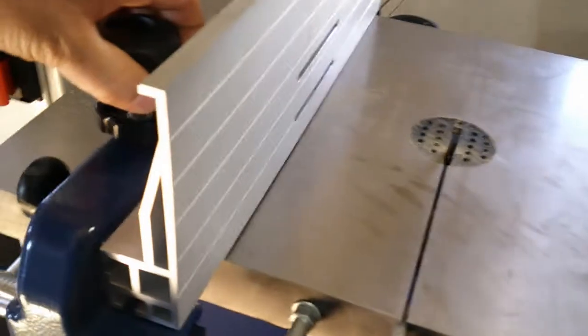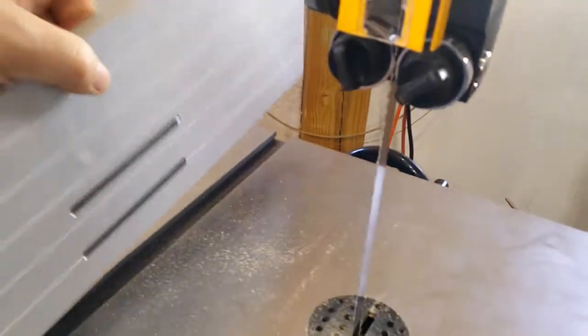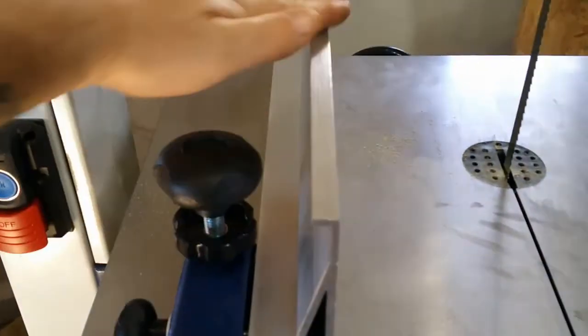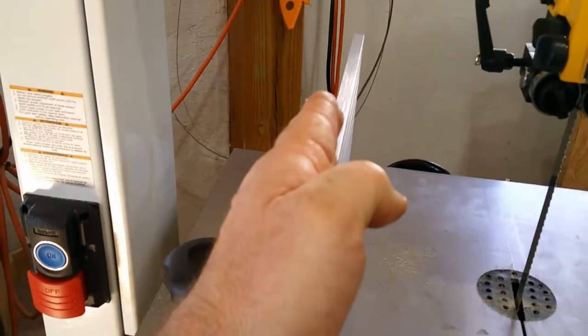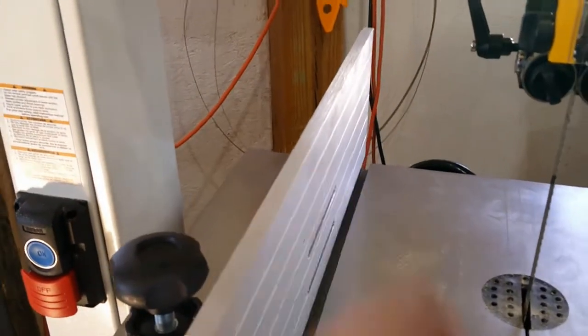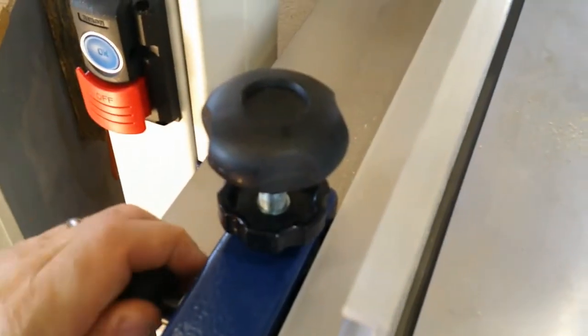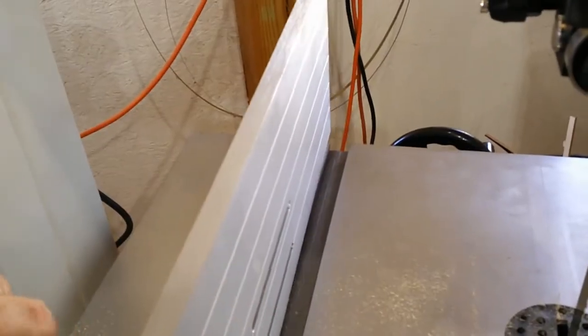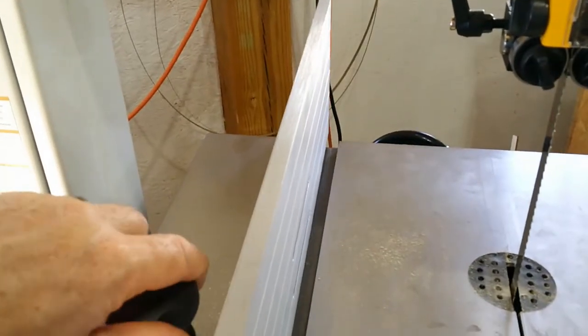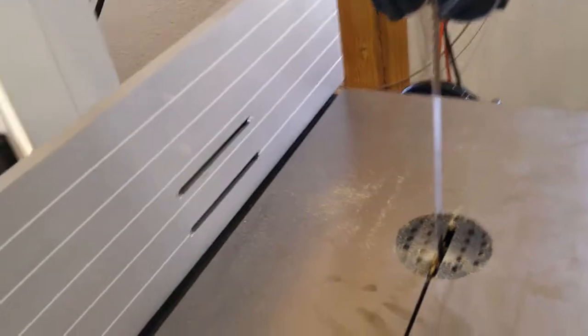Obviously this is your fence. It slides very smooth, back and forth, up and down. It can come off of there — you can take it off and lay it flat for shallower cuts. One feature that this saw has that I don't know many others do: this knob right here will take that fence and cant it one way or the other to give you a true 90 degree angle. This one locks it in place, this one is the adjustment. So we loosen that, and you can see when I turn this knob the fence moves away and then you can turn it back in. Once you get it 90 degrees to the saw blade, you lock it in place and you're good to roll. On/off switch right here — nice big red oh-crap button to punch and stop it.